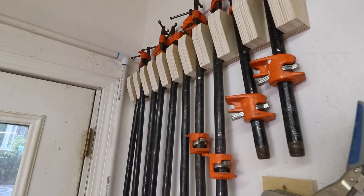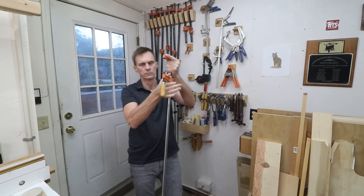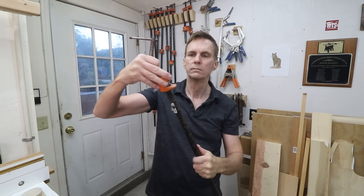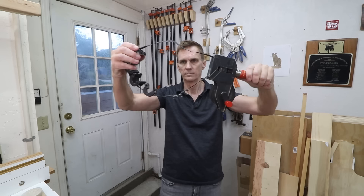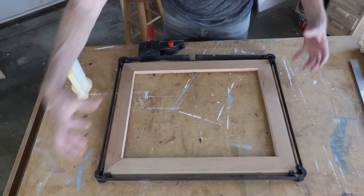There's an old woodworking saying that you can never have enough clamps, and there's a lot of truth to that, but you don't need a whole lot to get started. There are just about a billion different types of clamps — probably more gimmicky versions than any other tool — so don't get overwhelmed by all the choices. I suggest getting two 24-inch bar clamps, and if you can swing it, a couple of 36-inch clamps too. I'm also a big fan of pipe clamps — a very affordable way to go. You buy half-inch or three-quarter-inch black pipe in different lengths, then get pipe clamp fixtures you can swap to whatever pipe length you're using, saving money by not having to buy the mechanical parts for every clamp. I also suggest every beginner get a strap clamp — very useful for gluing up picture frames, boxes, or just about anything that needs to be squared up, which is most projects.